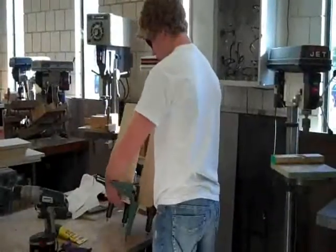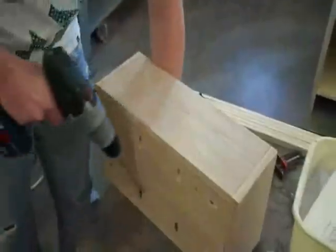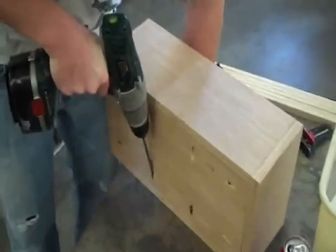This is how the drawers are made — with pocket holes and right angle clamps to make sure the thing is square, and a long drill bit so the drill doesn't get in the way of the drawer. After that you have to put the bottom piece in, which is just held in place with pocket screws facing down so that when the drawer is open you can't see the pocket holes or the screws from the inside.